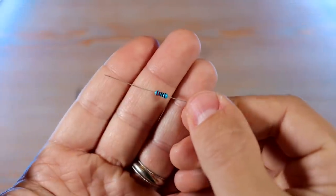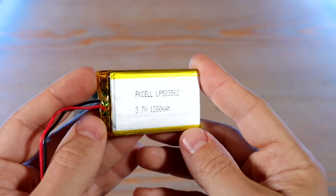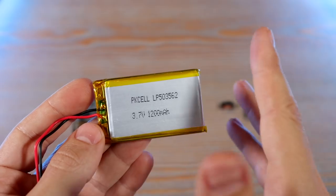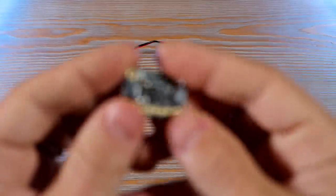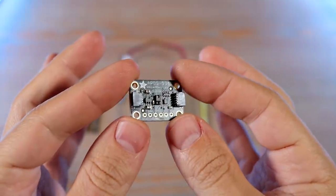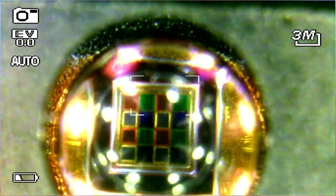There's an infrared receiver to read commands from your TV's remote, an infrared LED to zap those commands back at your TV, a resistor to put in line with that LED — this one is 270 ohms — a lithium polymer battery, this one is 1200 milliamp hours, but there's room in there if you wanted to put a bigger one in. And then there's this board from Adafruit that uses the APDS9960, a really cool sensor that has an infrared LED plus tiny photodiodes that can sense the infrared reflected back at them.